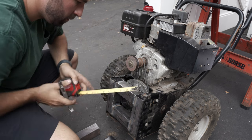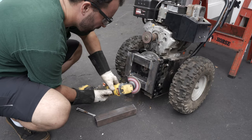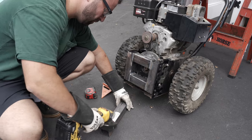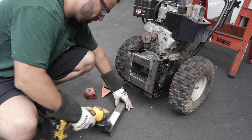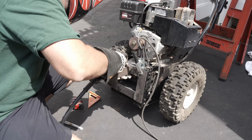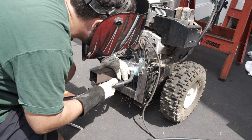Next up I marked the center to mount the horizontal piece that would hold the trailer receiver. The reason I used the horizontal piece underneath the trailer receiver is that welding the receiver directly to this tubing would have been pretty difficult — the hitch receiver was so much thicker than the tubing. By laying the two pieces of tubing on top of each other you'd be welding corner to corner, which allows welding at a hotter temperature and achieves a stronger weld.